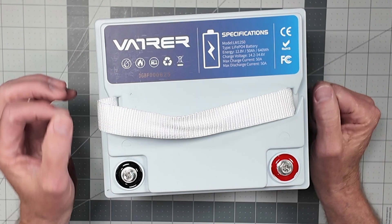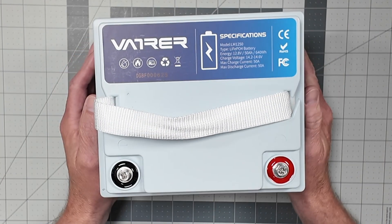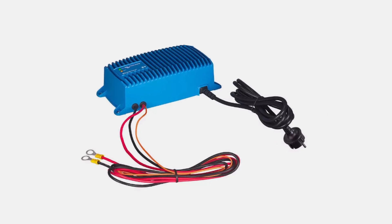I'm going to test this out with one of my radios to see how much current we're drawing — it'll give you an idea how long this battery would last in the field. Typically a battery like this, even the bigger batteries, recommends charging at a slower rate. The recommended charge rate is 20 amps, although the manual does say you can charge at 50 amps. If you want this battery to last longer, charge it at a slower rate — the slower the rate, the better for longevity.